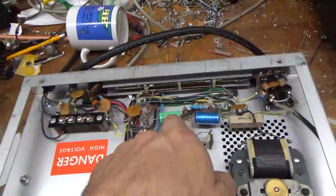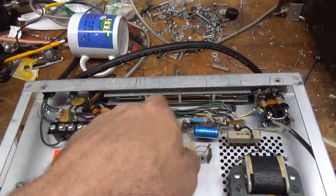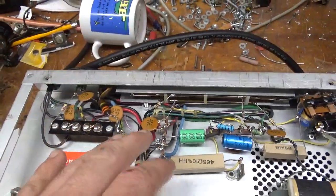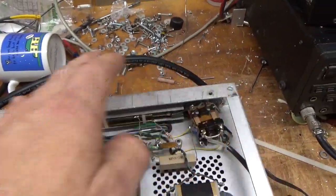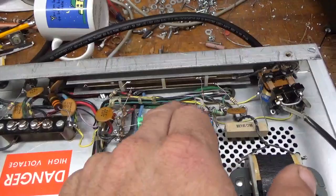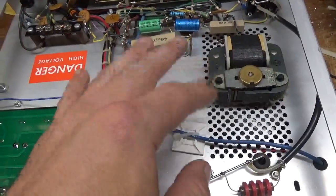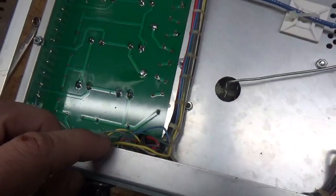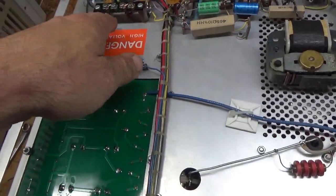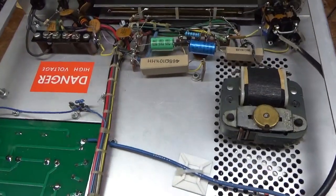Okay, here's the bottom. Replaced this electrolytic, replaced this resistor, replaced that resistor. Ended up having to take the whole directional coupler assembly out so I could replace the output SO239 — that's all set. Cleaned the contacts on the TR relay. Also replaced this resistor — it was way out of tolerance, this one was severely overheated, that one was blown apart. Oiled the fan. I put this in to hold the high voltage wire so it's not flopping around. Cleaned the multimeter switch with Deoxit Gold. Cut back the cord and re-soldered it in place — it had damaged insulation. I'll show the back next.